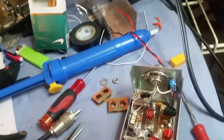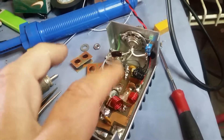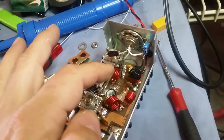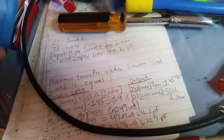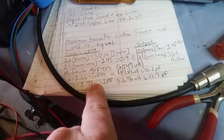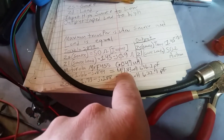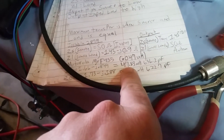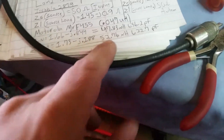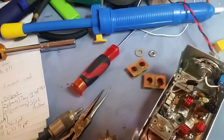At this point I've found myself quite frustrated with this amp. Both of the coils were wrong - they were not where they needed to be. I've got all the math right here that I had to do so I'd know exactly what inductance each coil needed to be. Around 30 megahertz, the input needed 47.8 nanohenries and the output 52.76 nanohenries. The input was at 75 and the output was around 40-something, so I adjusted the coils and it still was not working at all.